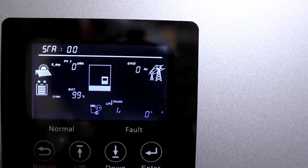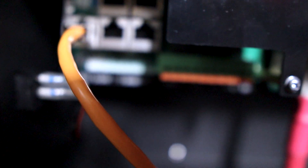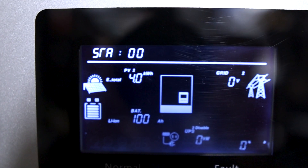As you can see, I got battery communication with my LifePower4 battery and the EG4 6000XP. Definitely wasn't easy to get set up — basically plug the communications cable down here where it says 'battery comms' on the EG4 6000XP. I got it connected to my LifePower4 battery and it has communications. I basically updated the firmware on the EG4 6000XP, then updated the firmware on the battery, and bam — it started working.